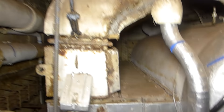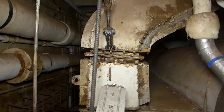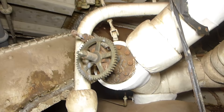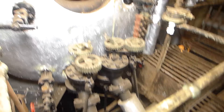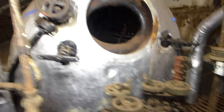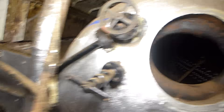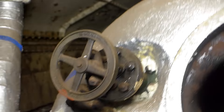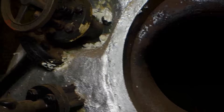There's a curved section on each side where the exhaust comes up after crossing over the boiler tubes and enters a single uptake on each side, going up into the drawing room. Here's where the real action is — this is called the steam drum. This is where water is pumped in at 400 pounds per square inch. There are two separate valves and inputs for redundancy and safety — if you have a problem with one, you always have another way of feeding it. There are also two sight glasses that can be used to look at the water level inside the steam drum. If one was clogged, you'd certainly get a false reading, so you'd constantly check both to confirm your water level.